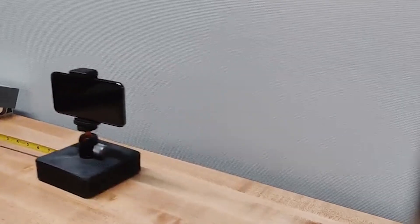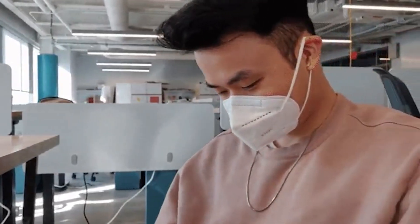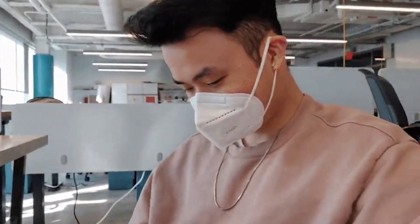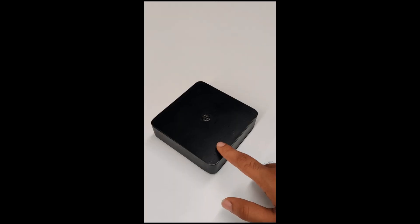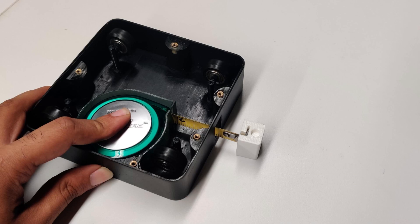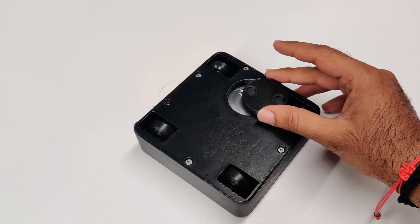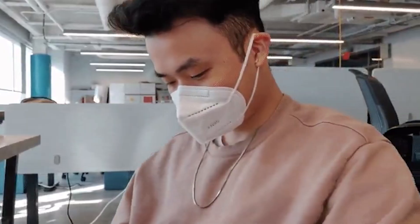I have to give a shout out to Slidy, the non-motorized camera slider by Shivam Dahinwal. If you've spent any time with us here, you know I have a little bit of an obsession with camera motion control, and I also love a simple hack — this project combines both. It's just a 3D printed enclosure that houses a few smooth rolling wheels. There's also a 1/4-20 mount for camera mounting and a tape measure. The tape measure is what makes this project special: not only does it enable the motion of the slider by retracting the tape, but you can also control the retraction speed by varying the pressure on the side of the tape measure. There's a threaded 3D printed part that lets you adjust that pressure to set the speed exactly to what you need. This is a novel approach to a classic problem, and a fantastic solution.